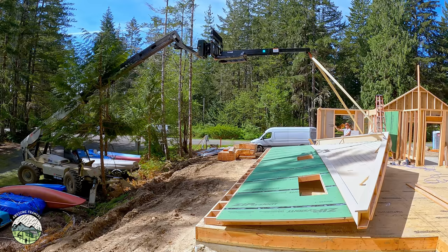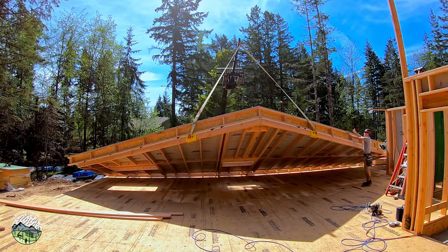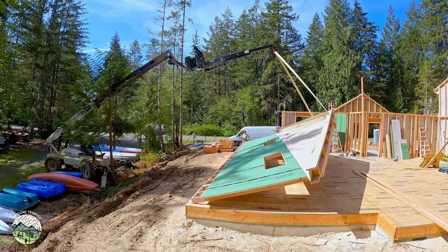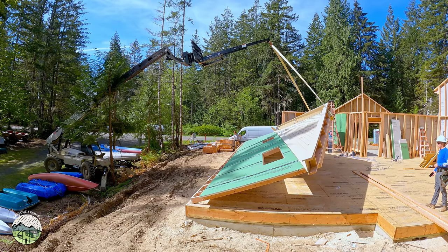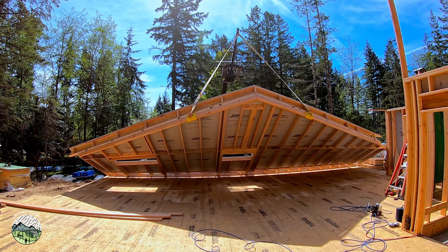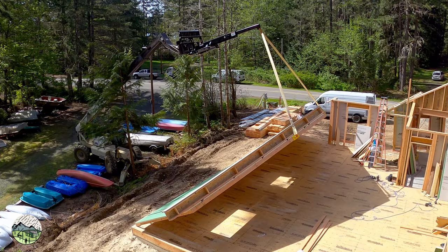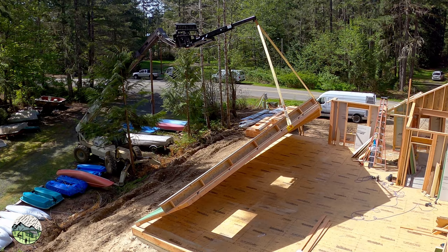We had to move a couple of boats to make room for the forklift, but now you can see why we double top plate our walls instead of using the rafter. It's an easier pick, easier to grab. Did you notice how stiff that wall stays? It's a little bit bent, but that 12 inch by 16 foot long LP soffit up along the gable — that's what keeps the wall stiff. We've been using this particular system with very little change. I can't think of a change in about the last 10 years, except that row of fire blocking.